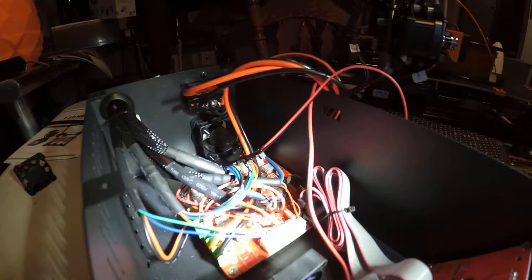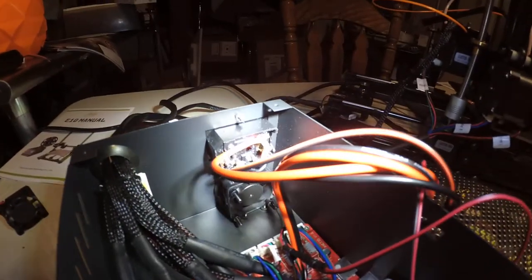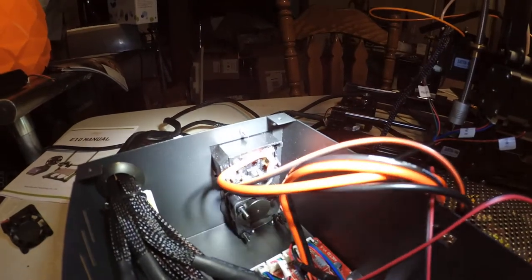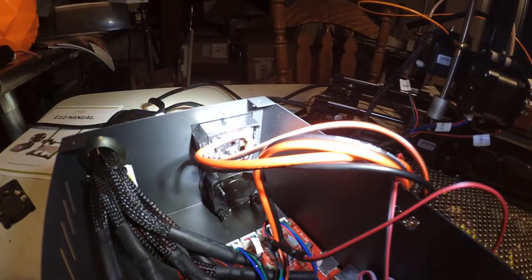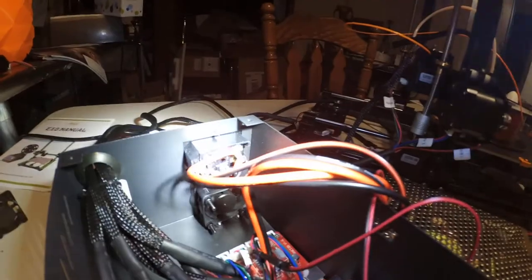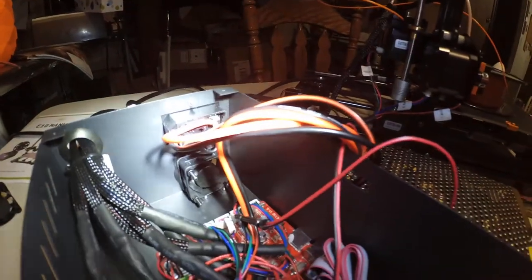Otherwise, I like the brain box in here. It's not bad. They have a basic stop to keep the wires from being tugged out of the box through the grommet. Even though these are all exposed, they are well soldered. You know, it's not garbage. I mean, if I did this myself, I'd be okay with it. I would like to see them have connectors and be spaded, for a better connection, but it's more exposed. And I would like to have seen at least insulation covering the connections, solder them lengthwise and have shrink wrap go over the spades so that they're electrically isolated, but it's not a big deal.